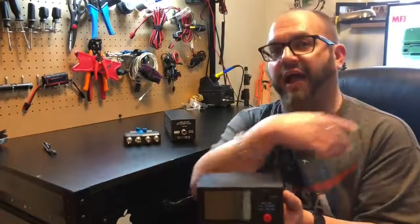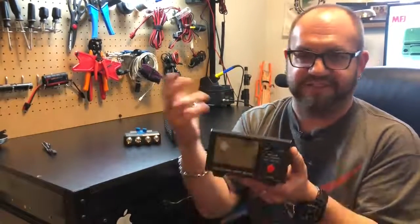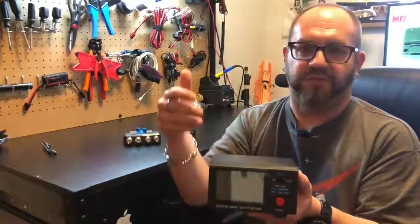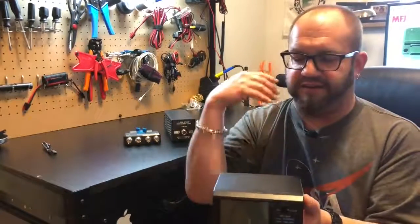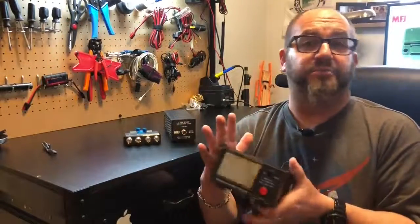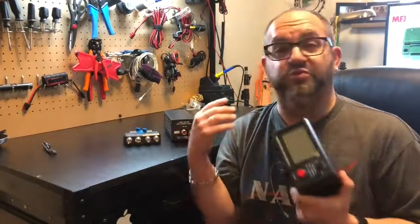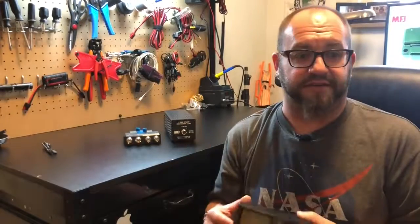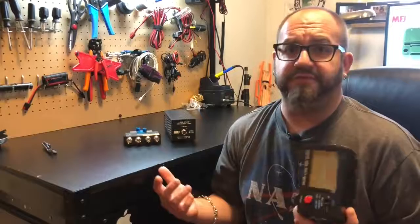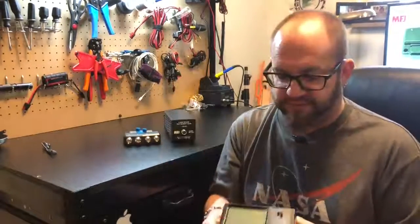You don't have to worry about frying out your VHF/UHF radio. Click over to VHF/UHF and that'll bypass you. You can see what your SWR is on your VHF antenna, how much power you're putting out. I wanted this more for VHF and UHF, because those types of radios don't have an SWR meter and you really have no idea how much wattage you're putting out — you just get a little bar, and that doesn't really mean anything. I want to know what it's doing.